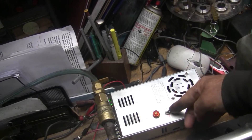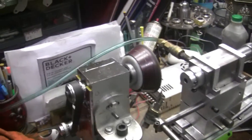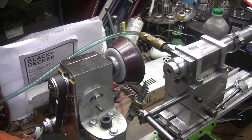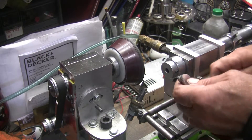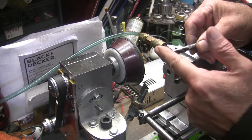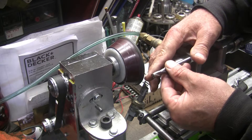Just flip it on. So we're going to sharpen some 3/8" end mills. I basically have it already set up. The finger holds the flutes so that it's straight across, and it comes in and touches the wheel at 5 degrees.